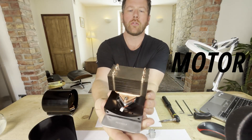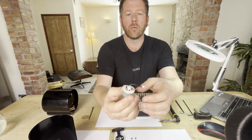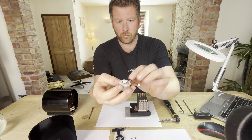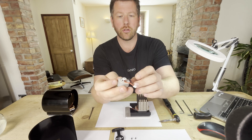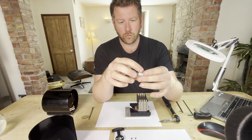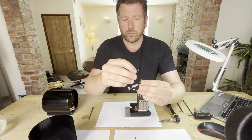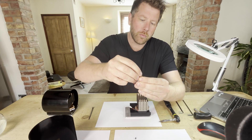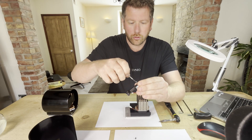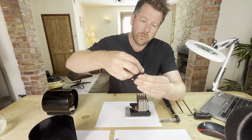The next step is to assemble the motor to the bracket. This is our bespoke motor that we've had manufactured — just a sample at the minute. There are a few things wrong with it: the shaft is too short, and we've upgraded the plastic part on the back to be more resilient. We've got better bearings front and back and better brushes, because we're spinning a lot faster than a conventional stove fan. It attaches to the motor bracket using M2.6 countersunk fixings — these should be M2.5 but they're M2.6.